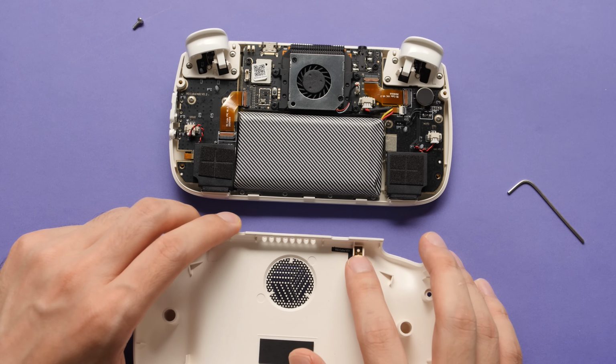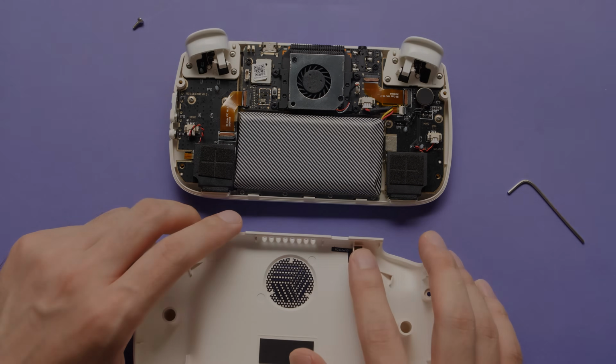That alone is the biggest cause of this light bleeding issue, and I can prove this to be the case by pressing against that spot with my finger without the back shell on. After I put the back shell on, you'll see the same spot on the right lights up. Right now, I consider this to be a design flaw, and when I get a chance, I'm going to cut that square from the back shell to remove this force that presses against the screen. Unless something changes with manufacturing, all RG Cubes should have this issue.